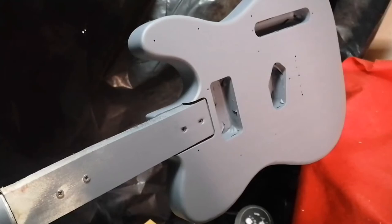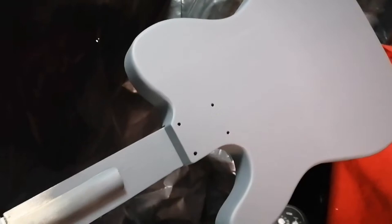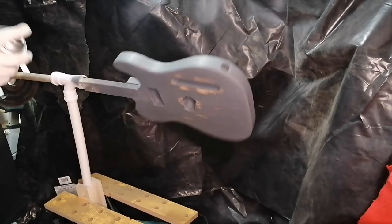Here is my actual third coat on the guitar body — I haven't sanded it back on the third time yet, but it's really smooth and really clean, and the stand works really well for getting into all the nooks and crannies. I was very happy with this, though I did sand back a couple of edges I wasn't happy about. Because the guitar had been grain filled, I was making sure it was all level with no ridges or bumps before moving on to spray painting with silver.